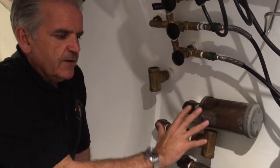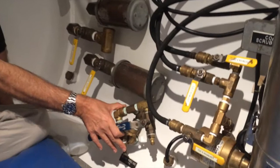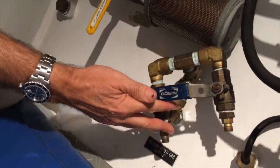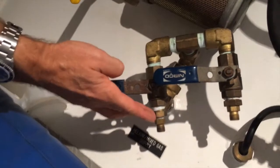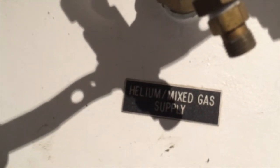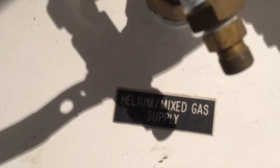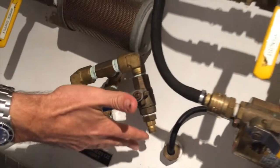Moving on over here on the outside, we looked at an external supply that went through a check valve with nothing hooked to it. There's nothing hooked on the inside either — it simply goes to a manifold here. We use this where we could run auxiliary heliox supplies or nitrox supplies to another bib mask. So these are ball valves to control that, and then we would have to plug the corresponding exhaust into this manifold here. So these are separate supplies.